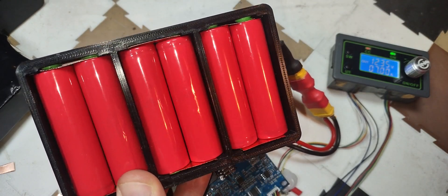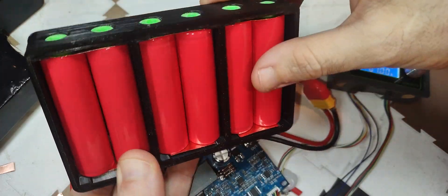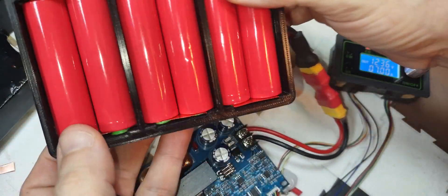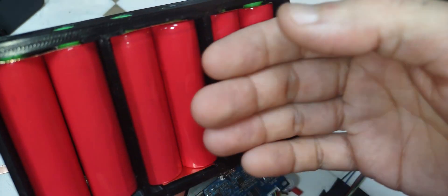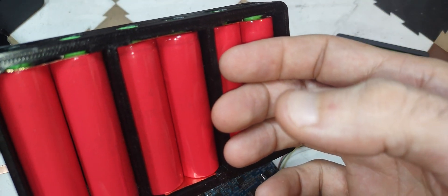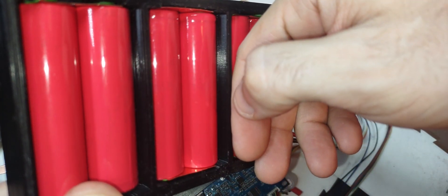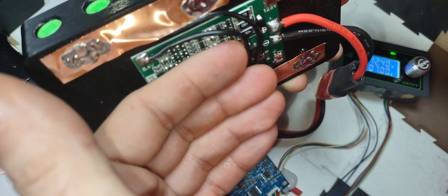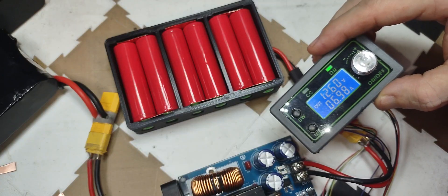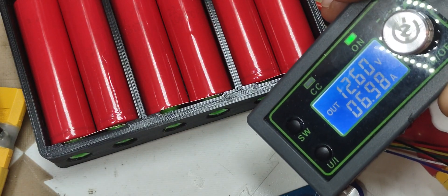Here are the connections — just screwed down with that copper strip. Current is happily flowing, no problem. The cells are as warm as you'd expect them to be. They're MH1s, very healthy MH1s, and they're at 3.5 amps load each. Barely noticeable, but definitely noticeable. The MOSFETs are like twice as warm. It's reached the constant voltage phase, so current is starting to fall, as expected.